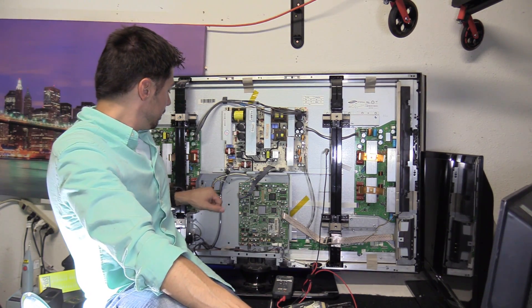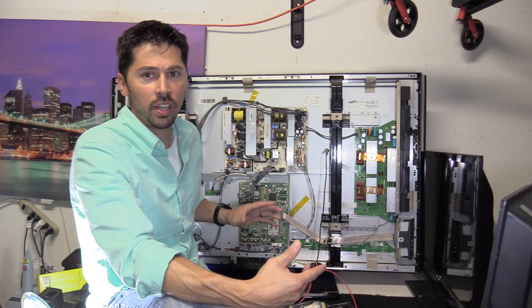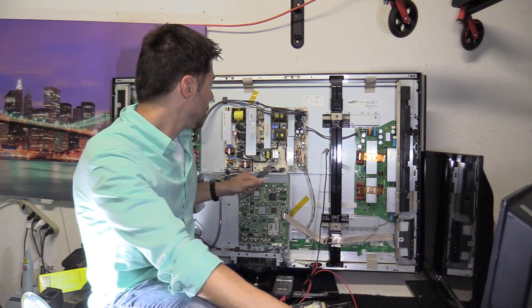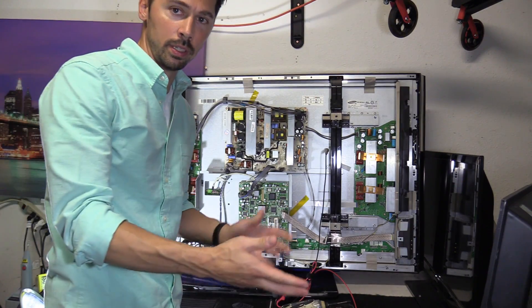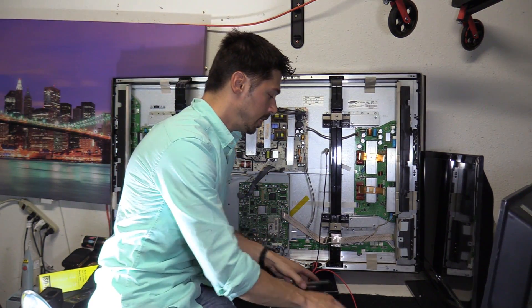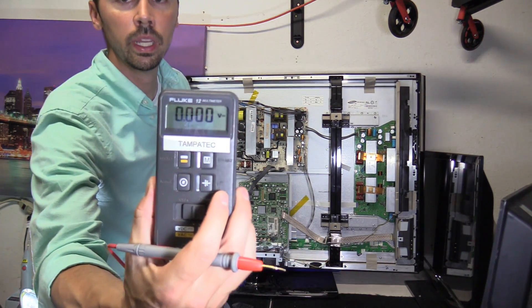The main logic board is basically the brains of the TV. The control board is buried back here — if you have colored lines in the screen, that can be a bad control board. I don't do too many plasma TV videos because they're fading out, but someone probably still owns a plasma TV, and they were expensive back then.